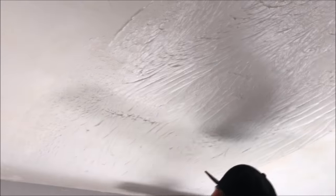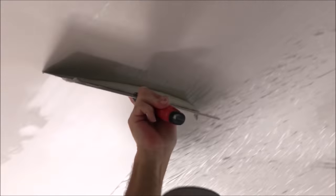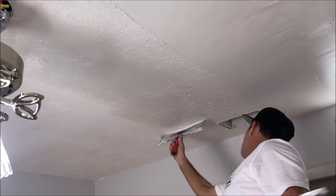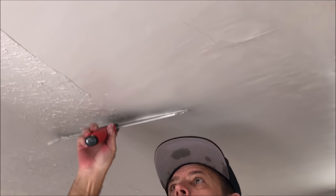I'm going to wipe it down just like I did the other section. I do have a couple obstacles like the ceiling fan and also the AC duct — no big deal, just go right around those. It's nice when you can just take a long walk down your walk boards and skim coat the whole time. I'm applying pressure to the right and lifting on the left — that's why you can see the line being formed on the right side.